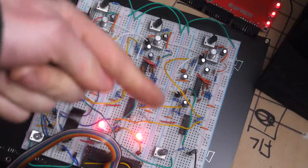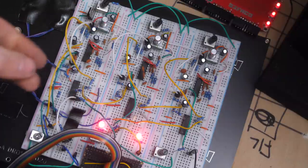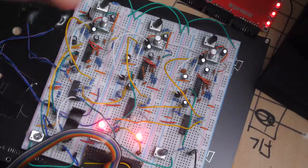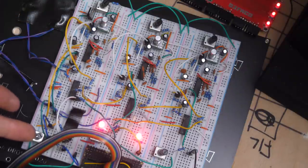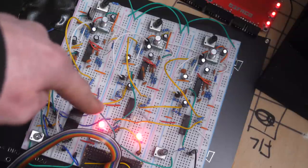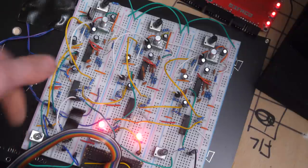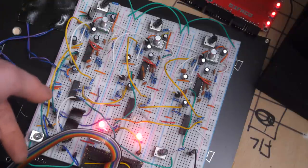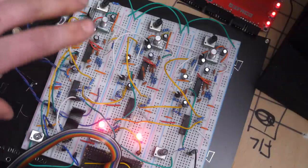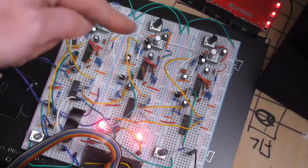I shot what you're about to see just after this, and I got lost in it, and it reminded me of a few things that I liked about the PT2399. Basically the travel of the potentiometer, and I did this by accident in this one, but I've done it before on purpose. The great thing is, if you turn it down to zero it completely shuts off, which means turning it up is another way of turning it on. It was a really accidental feature last time, and it was really useful, and it's happened again this time, and I think it's great.